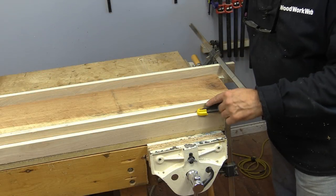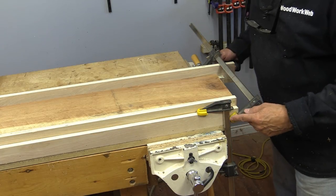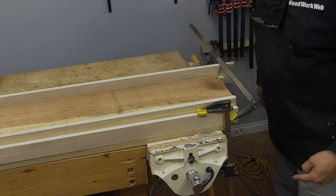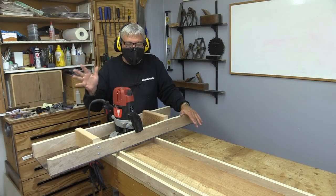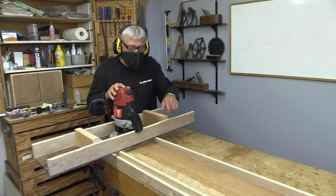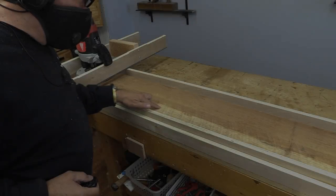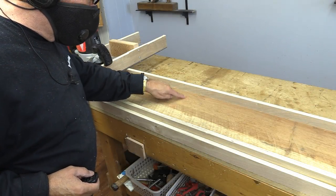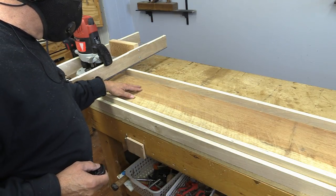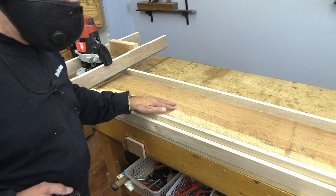Here's the wood I'm going to plane. You can see the jig rails are clamped to my workbench and the wood is clamped inside the jig. This is a pretty dusty process and I'm not going to do the whole board, but I want to show you the saw marks and what we can do to get rid of them. The board is pretty rough with visible saw cuts, so I'll start by just taking a skim across it, then lower the bit a bit and do a little more — you always do just a little bit at a time.